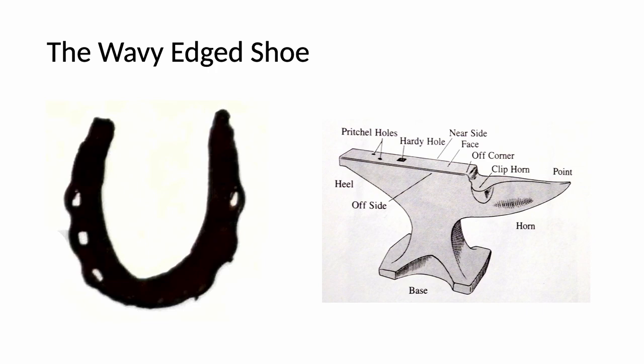This is one of the earliest shoes, and you can see that where the nail holes were knocked in, they couldn't control the outer edge and it became wavy. It wasn't until the invention of the anvil — that's the image on the right — and the horn on the anvil, which is the pointy rounded bit, that you could put the shoe onto it and keep the outer edge of the shoe smooth. So later shoes don't have this wavy edge. It's generally considered that this was introduced by the late Romans or the Normans, though I don't think anyone is quite sure.